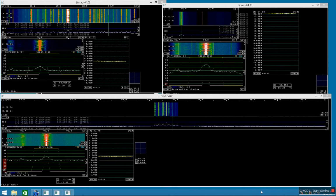The reason for the very poor performance you have seen so far is that the tuners are not designed to be used as wideband receivers. They have IF filters, and since the IF is very low, these are on low frequencies.